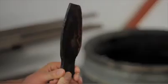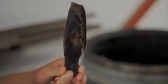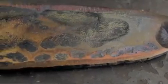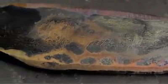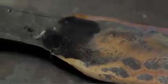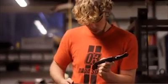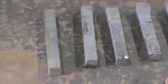It should never go above the critical temperature because it will enter the annealing heat stages again, and thus relax or spread the molecules out too much. Once again, this is simply a demonstration, mostly to see the wide range of oxidation colors. The warped colors on the knife would ideally be a solid one for a finalized product. Once the steel is done being tempered, the knife is tough and hard enough to be sharpened, polished, and finalized. And that is the entire steel heat treating process that turns this ordinary block into this final knife.